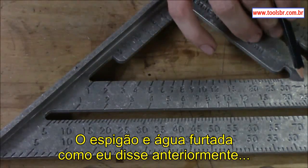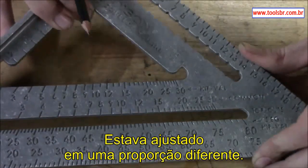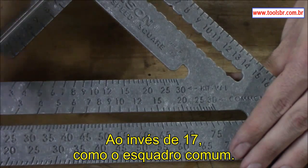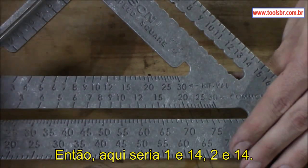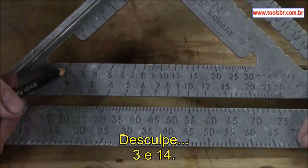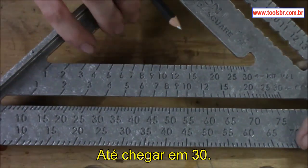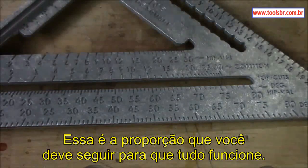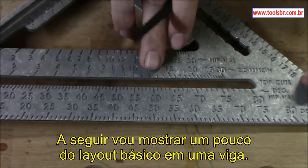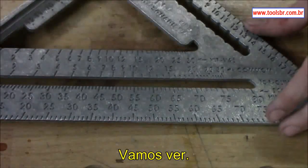The hip and valley on the metric was set at a different ratio — fourteen instead of seventeen like the standard. So over here it's one-and-fourteen, two-and-fourteen, three-and-fourteen, four-and-fourteen, and so on all the way to thirty. That's the ratio you have to keep track of in order for all this to work. Next I'm going to show you the basic layout for a rafter — what you'll cut and everything.